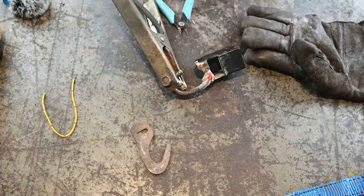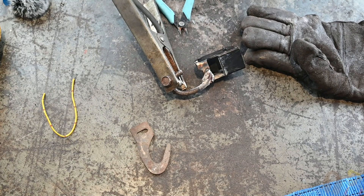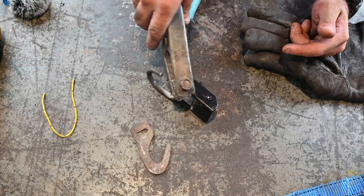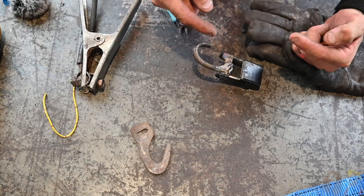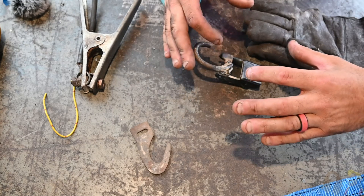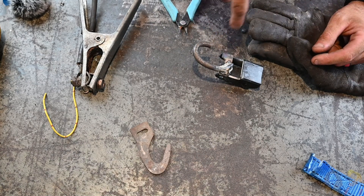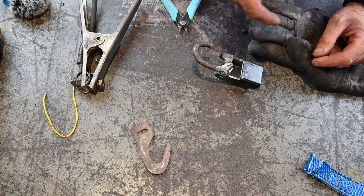At this point it is probably about 90% done. There really isn't much work to it, so I'm going to let this thing cool off and get it cleaned up a little bit. I'm pretty confident that hook is straight — straight as it needs to be. If it is not straight, that buckle will twist on you as you pull it, and it'll cause the webbing, instead of pulling straight through, to pull to the side. So you want to make sure that it's on there straight. I'll get this cleaned up, let it cool off, knock off some sharp edges, and we'll get the webbing back on there.